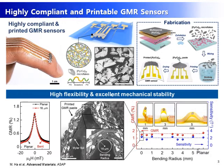For the preparation of GMR paste, we fabricated 30-layer Permalloy/copper thin films and further performed exfoliation and dissolution to transform them into microflakes. These microflakes can be well mixed with binding polymers to form a viscoelastic GMR paste, which is easily printed and strongly adhered to any substrate. Also, the fast evaporation of the solvent in the binding polymers causes extremely volumetric shrinkage and a high percolation network between the microflakes. The resulting on-skin GMR sensor is conformally attached to human skin and has high flexibility, which can be bent down to a 16 µm bending radius with high GMR performance and sensitivity.